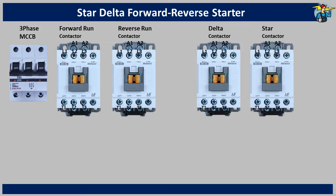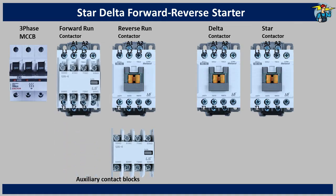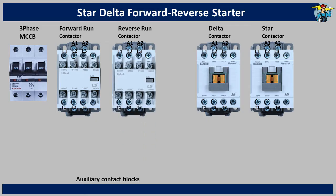Here you will see there is only one set of normally closed auxiliary contact points available on these magnetic contactors. For control circuit wiring, we require more auxiliary contact points on the forward and reverse contactors. So we introduce two additional auxiliary contact blocks for the forward and reverse magnetic contactors. Fixing can be done easily by sliding those down the slots provided on the contactor front.